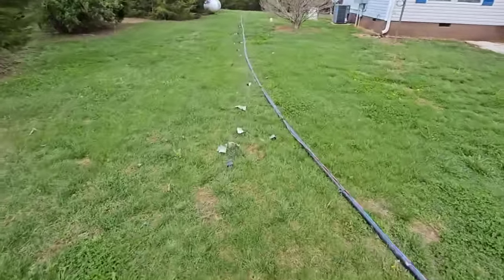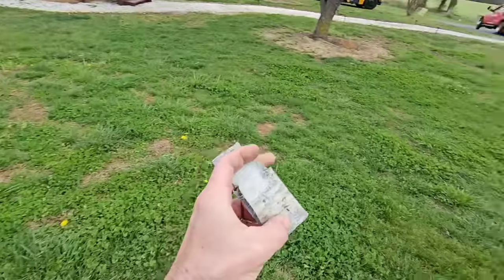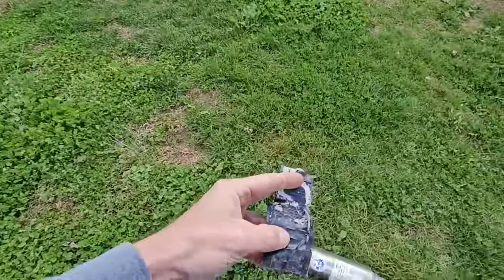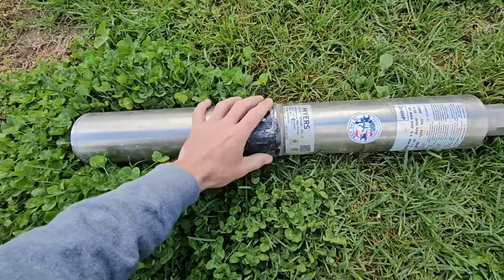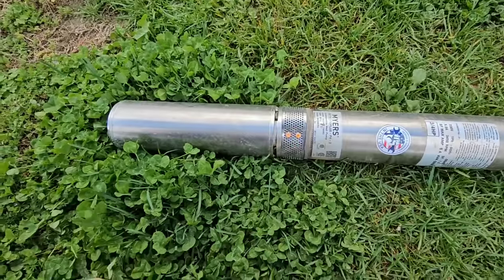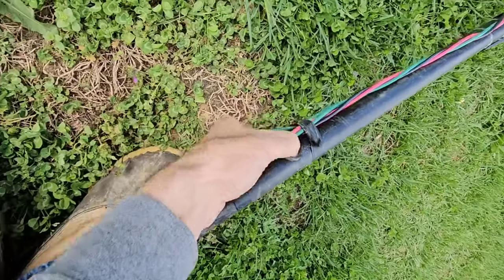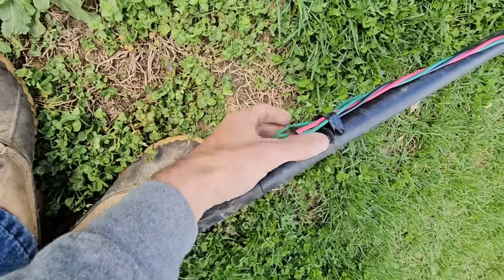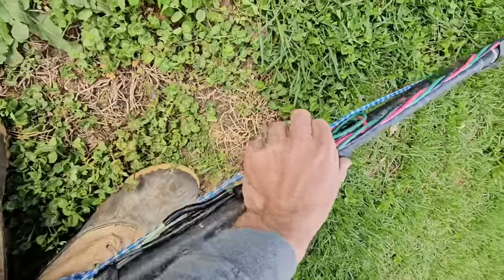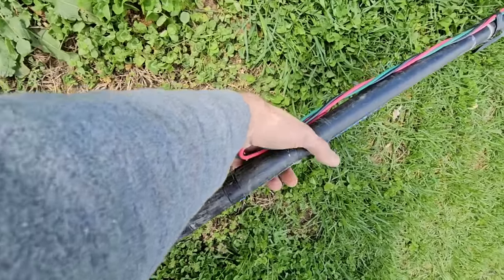While we've been fracking, Mike's been going down the pump system taking off all the old duct tape. Can you imagine this stuff when it falls off in the well? This is why you don't use duct tape - just two or three pieces can perfectly block the intake of the pump. I've pulled well pumps out where it's just a wad of duct tape sucked to the intake and it wasn't working. Also, don't make a bundle near the pump like this. You can do it up below the well seal, but not down near the pump, because you're not going to get any stretch down here. The idea is if the pipe stretches, it gives you a little wire to go with it - but this is just a point of failure.